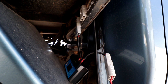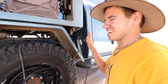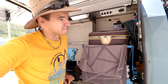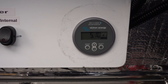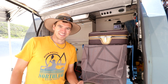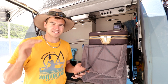Just to explain what's going on with the cheap solar regulator — I've got three Anderson plugs here. One hooks up to the solar, the other is straight to the battery. For the test with the cheap regulator it just goes directly from the panel to the battery. Alright, I've plugged in the iTech World $300 solar panel — the solar regulator is going to take a little while to kick in. At the moment we've got the iTech World panel putting in 5.1 amps through the cheap eBay-style solar regulator, which is pretty impressive. So let's chuck on the $99 Sunye panel and see how that goes. Wow — it's just stabilised and at the moment we're sitting on 6 amps. Even with the cheap regulator, the Sunye panel is still performing so much better. I am literally mind-blown.